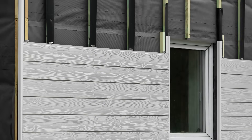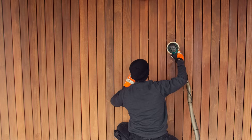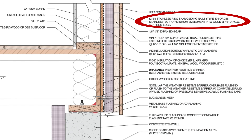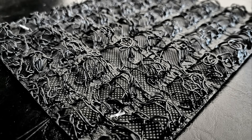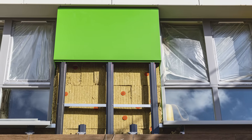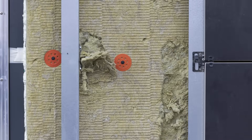You don't want too big of a gap either, otherwise fire and critters can easily travel up that space, and so we want to limit the gap to about 1 inch maximum in most cases. Sometimes we need more than an inch if we're attaching wood claddings over rigid insulation, as these claddings require an inch and a quarter fastener embedment — but this is the exception, not the rule. There are plenty of ways to achieve a ventilated drainage gap, whether it's standard wood furring strips, corrugated plastic battens, entangled mesh, or dimple mats. The point is, we want the benefits of drainage and drying to ensure that our buildings remain durable for the entire service life of the structure, and it also provides some well-needed redundancy to our wall assemblies, especially if we have imperfections in the water control layer.